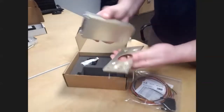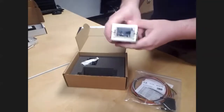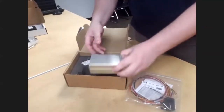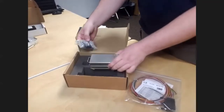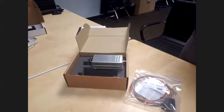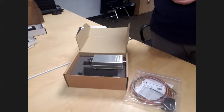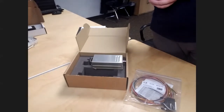And the transponder comes in two models. There's kind of a higher powered and a low powered one. If you're in the US, you basically have to have the higher powered one to be ADS-B out compliant. And the transponder, it's a Mode S transponder. It's basically controlled remotely from the display. There's no dedicated control panel with physical controls.